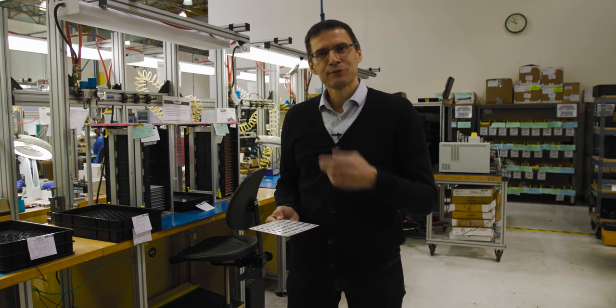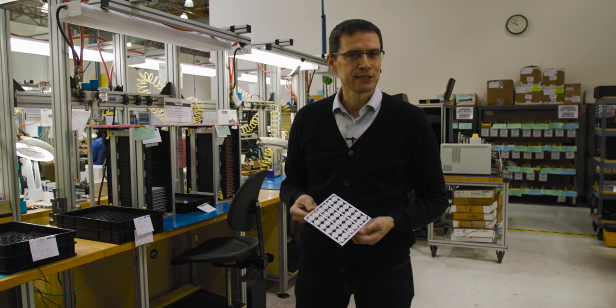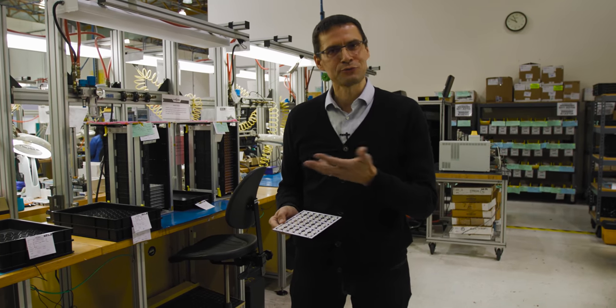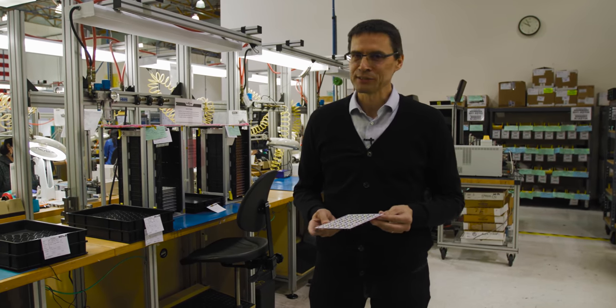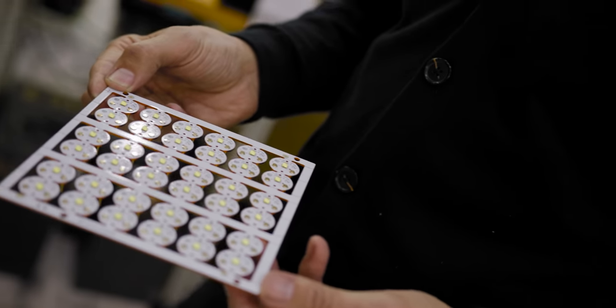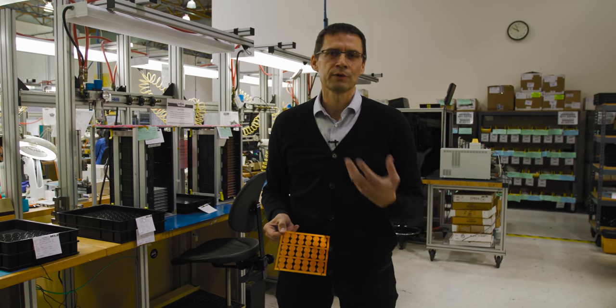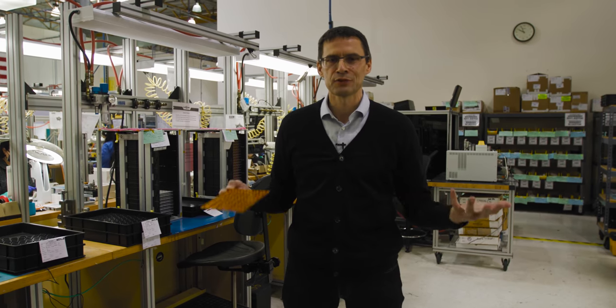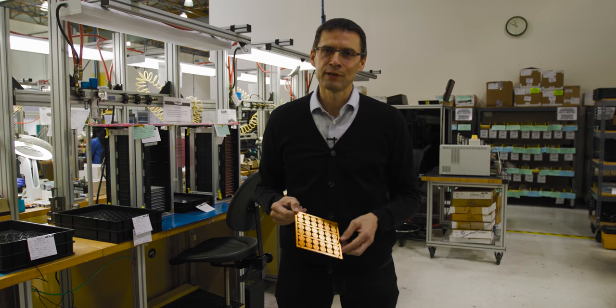After the brain assembly — the CPU board and power boards — we also need the LED assembly, which the power board and CPU board drive to produce light. This is called a metal core board. We've transitioned from aluminum over to a more expensive copper board because copper has better heat transfer, moving heat to our heat sinks, which transfer it outside to the environment and away from the LED.